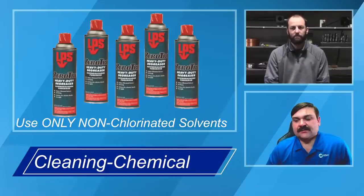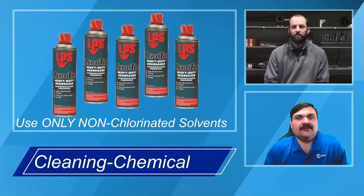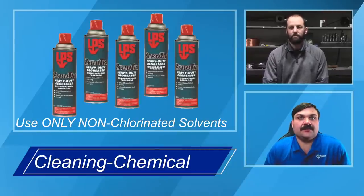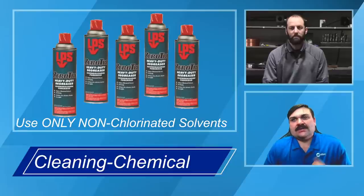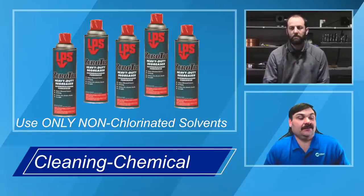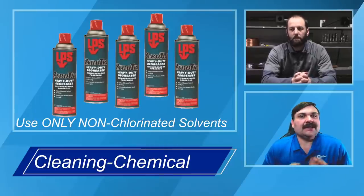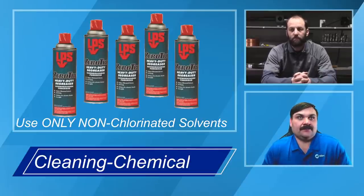And that's not to say that some of those acids won't work. You definitely just want to be careful, though, like Andrew said, from the safety side of things. If you're looking at an acid, what is the welding recommendation for that from the manufacturer? Does it need to be neutralized before you weld on it? Anything like that. So any of those acids, you're definitely going to want to make sure you know from the manufacturer what their procedure is to use it, because they're definitely out there to strip that oxide layer off. A lot of trailers use it. So some of those shops that might do the aluminum bright kind of cleaning, yeah, that sounds like it might work really well. And maybe it will. You just want to make sure that you're going down the right steps where you're not putting yourself in danger by using one of those as well.